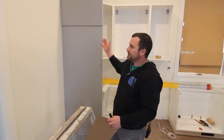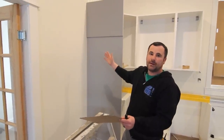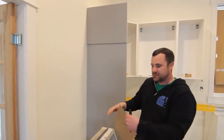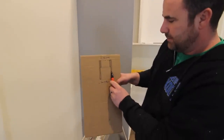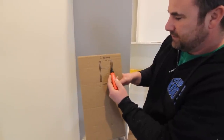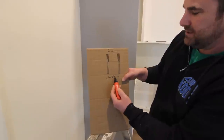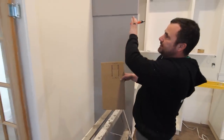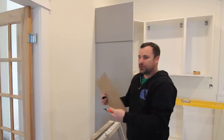Essentially what we're doing: set the panel, put the upper cabinet in, bring the other panel down. Don't slam the upper cabinet in yet — we have to leave space for the 36-inch fridge, with some space on either side. I have two gable panels: one gable panel here, a short 20-inch high panel, then 36 inches for the upper cabinet, another panel, and then the final gable. So I'll actually have 37 and 3/8 inches of space for the fridge. If you want to space out more than that, you have to get a little more creative with your filler panels.